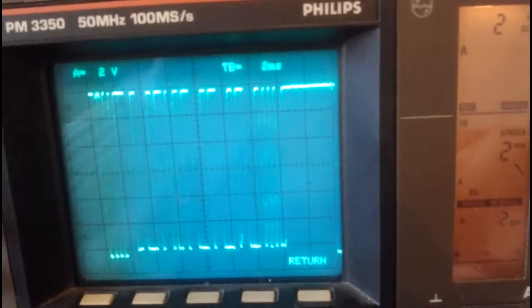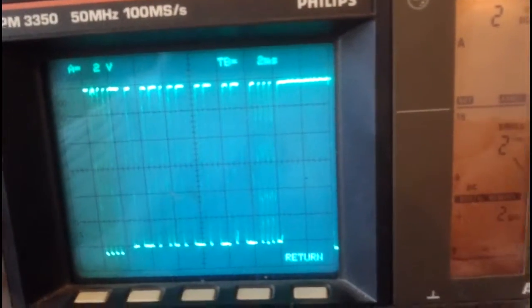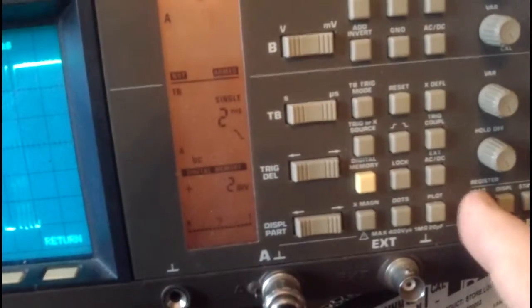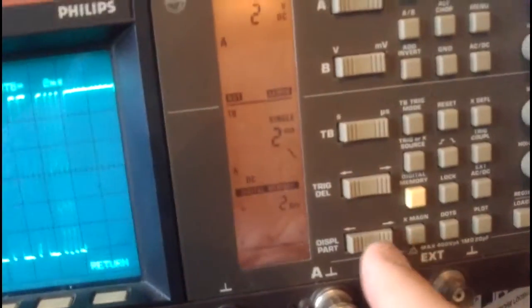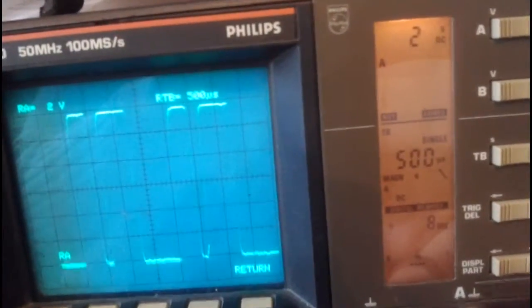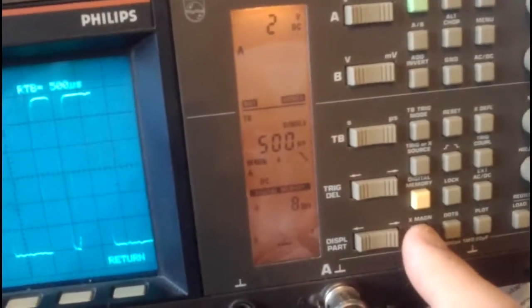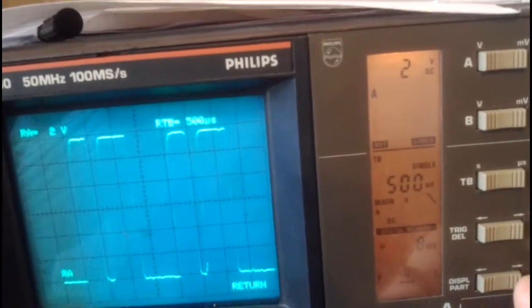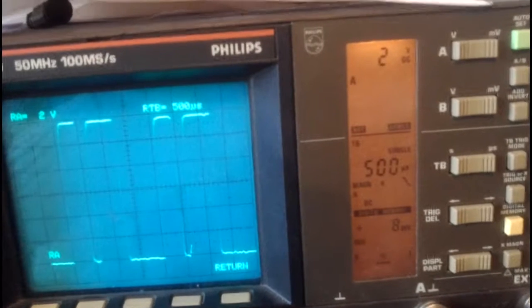Obviously I have nothing on that one that time. Here we have a signal that I would like to look at, so I press load to store that into my memory, and then as I press display I can cycle through and come to the 'RA' and look at it in detail. I can now move about on the signal, amplify sections of the signal with this button here, move along the signal, and look at the edges I am wishing to look at. Let's stop.